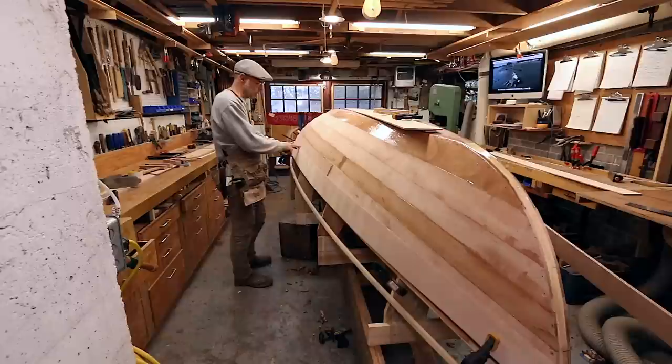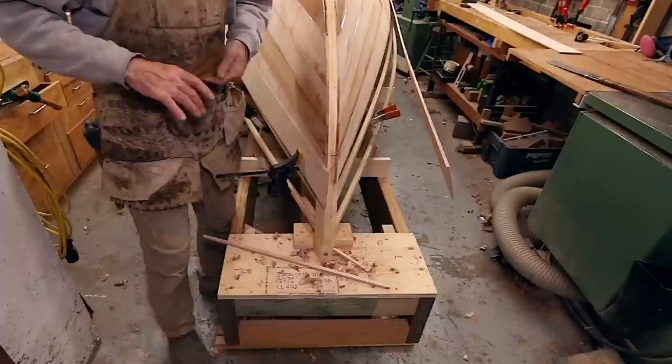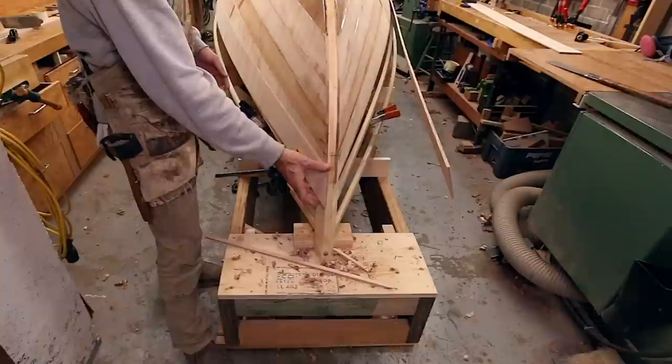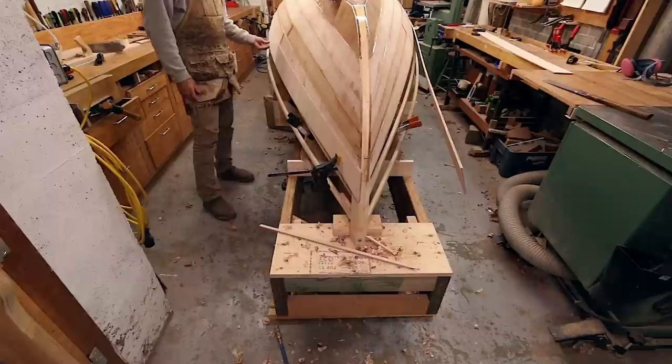Right here we start rising, rising, rising. By the time we've gotten down to the stem, this end has risen up a full two inches. That is too much to fudge in. If I had left my tail ends wider, I could probably pull it off because I could fudge one end up a little bit, re-trim it a little bit. But I'd already cut it to full finished thickness at both ends — I lost my fudge factor. Right about here, about six feet back, I'm still overhanging my batten down below a little bit. By the time that zeroes out and I'm not overhanging that batten, that's as far as I can go.